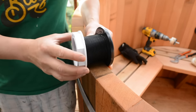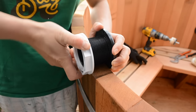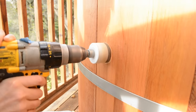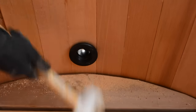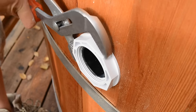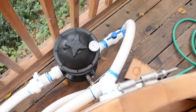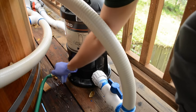Finally I get to the plumbing, though I won't go into detail here. One challenge I struggled with was finding fittings for a thick body tub versus a thin body plastic tub — this Pentair long body fitting did the trick. My hot tub has three jets and two suctions. I bought a spa pack from spaguts.com that comes with a heater, pump and controls. I've also hooked up a filter and an ozonator. At the bottom of the filter, I have a hose that will be used to drain the tub most of the way so I can access the plug in the floor.